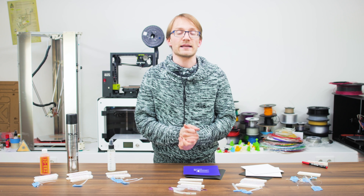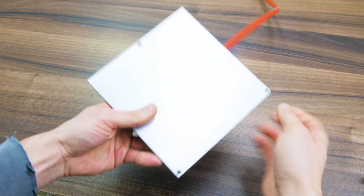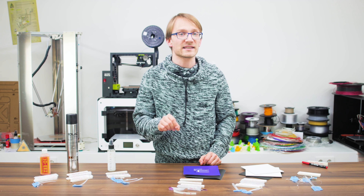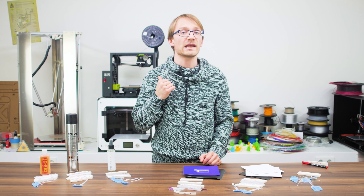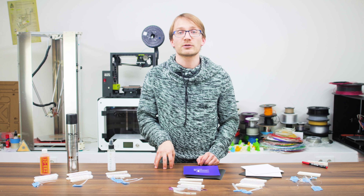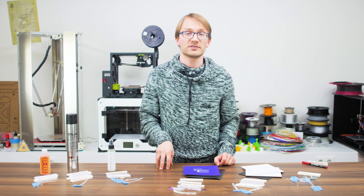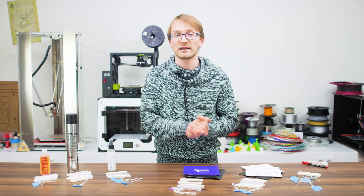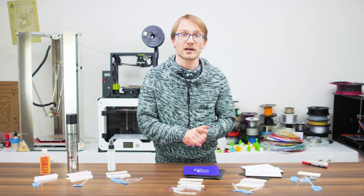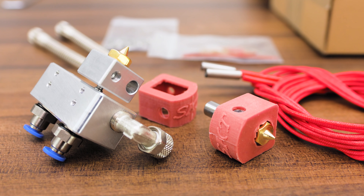And lastly, PEI. It's actually quite hard to tell that this bed is coated with a layer of PEI, which is chemically somewhat similar to Kapton. It's a pretty hard surface coating when cold, but does get quite squeaky-sticky once it's heated. From the testing I did for this video, as well as with the printing I've done on the Lulzbot Mini, I can say that PEI is an extremely robust coating and isn't going to show any sign of wear anytime soon, even if you're heavily using it. Sven Krause, the guy who made this PEI-coated bed, calls it a permanent printing plate for that exact reason. By the way, that is the same guy who sent me that insane water-cooled hotend, and unlike that last one, this one is definitely going to work.